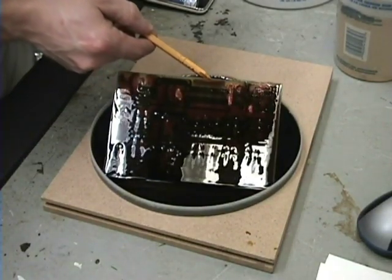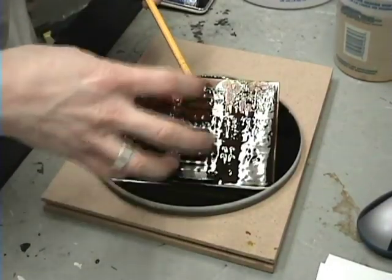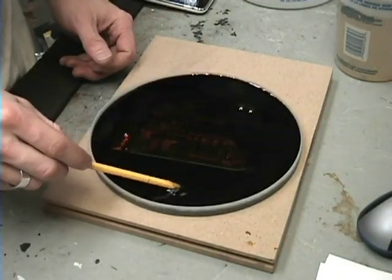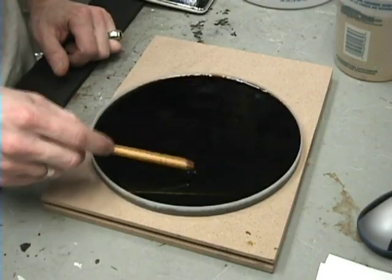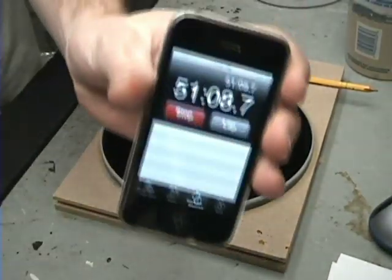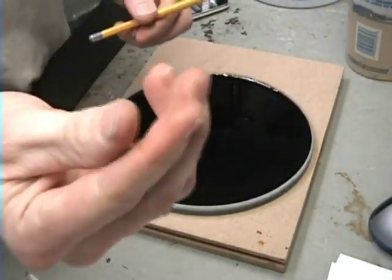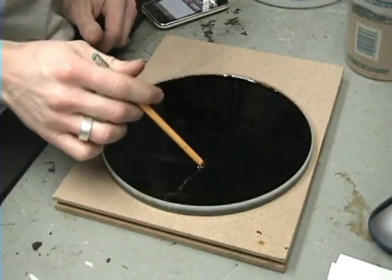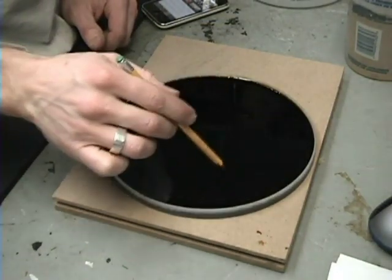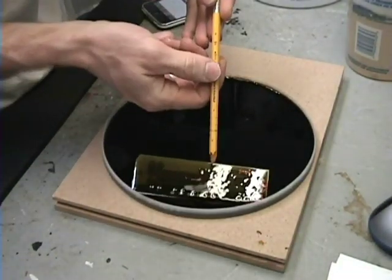It's been 46 minutes. The one in the middle isn't being eaten away as much — that's because the board isn't being agitated and the solution just sits there. At 51 minutes I'm checking this little one. This stuff is staining my hands — it's really nasty. You can't really reuse it because the copper dissolves into it, so I try to use it sparingly.